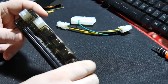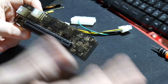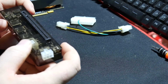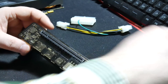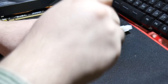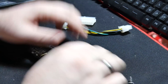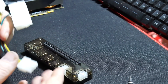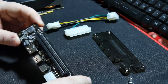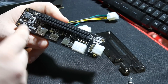So, inside this little guy — I do like the smoked housing that it has — basically inside this is a bunch of passives with a couple chips here and there. There's an 8-pin there. You've got a dip switch there. When I got mine, I actually had to open it up because it wasn't set to run on an ATX power supply, which is what I bought. So you have to open up the case and there's a little dip switch that says ATX power off/on, and I just flipped mine to on.